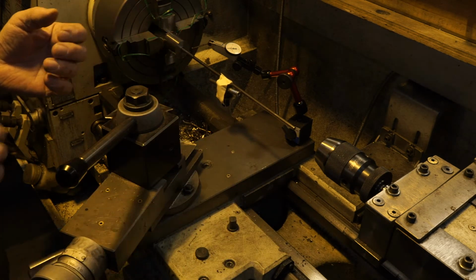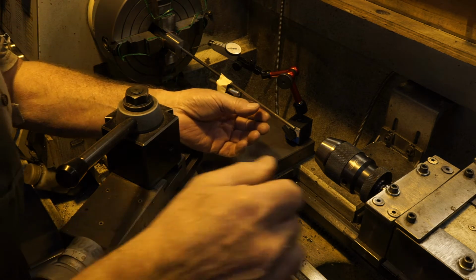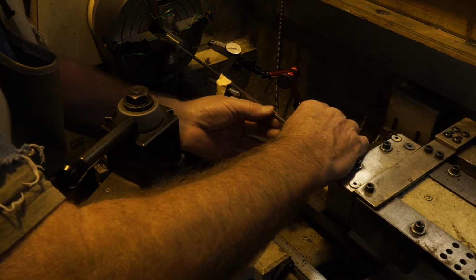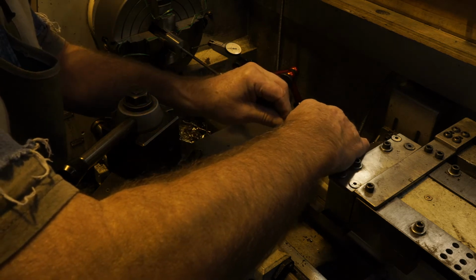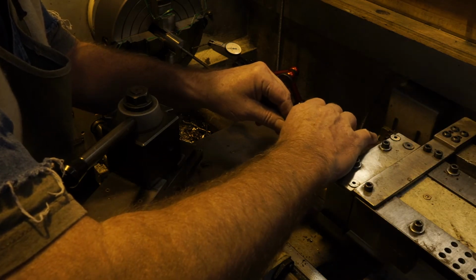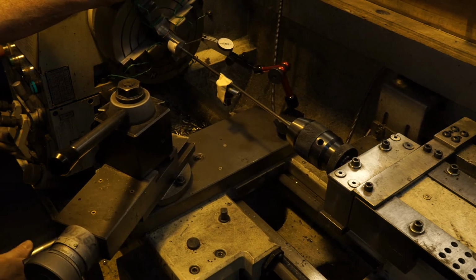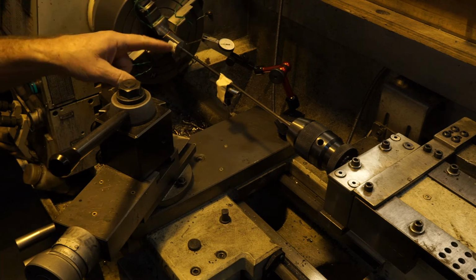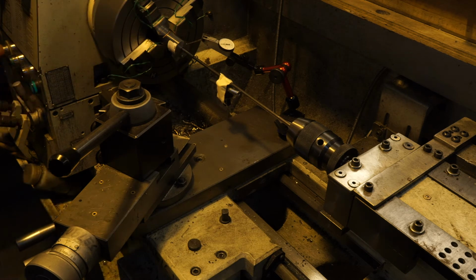See, the dirty little secret that I've shared, but maybe some of you haven't watched or don't know, this rod's a little bent. It's been abused. It's been used and abused. So, I disengage it. This weight that I'm hanging on here is really kind of redundant because this rod is already bent to a bias. In its length, it's got, I don't know, 30, 40 thou runout.